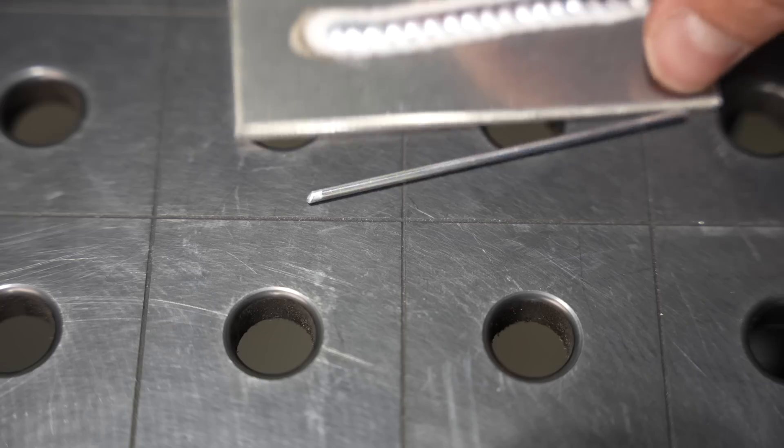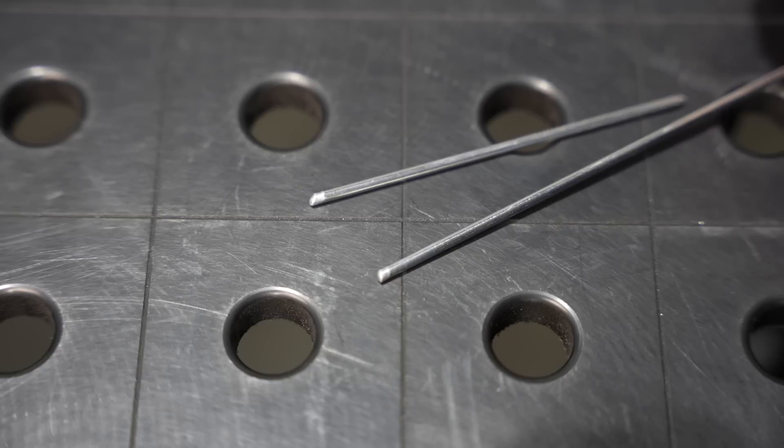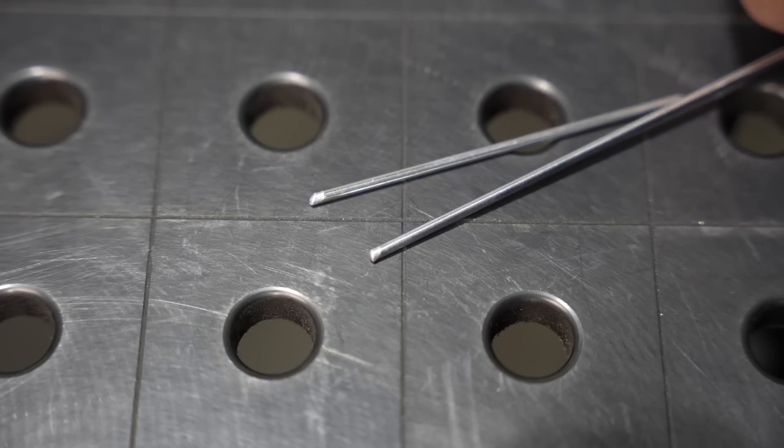When I do this, I'm able to get a pretty good result as far as the finished welds. After you finish your weld, it's best if you look at your filler metal and see a bit of an angled cut off the end rather than anything drooping down. That's an indication that things are going pretty well — you're dabbing in there quickly with intention and then getting out of that weld pool. Keep an eye on that and take a look at the end of your filler. If things aren't going well, it's probably going to be one of these three problems. Thanks a ton for tuning in today. If you learned something from this video, let me know by hitting that thumbs up or leaving a comment. If you have a question or an idea for a future video, I'd love to hear them. Thanks a ton — we'll see you next time.